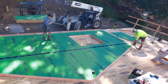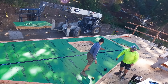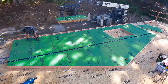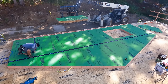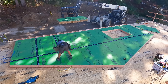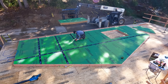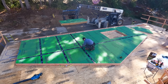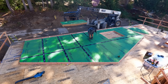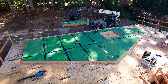This is why we trade everything off — you notice I just smoothed it with my hand as I went, then cut it off and we're going to roll that tape. You have to roll the tape — it's a pressure-sensitive acrylic adhesive. Now Kyle can run through and tape all the seams. Here's an advantage of not staggering your seams: you can literally just run top to bottom or bottom to top. We ran the horizontal seam first so that these seams overlap it. This is a self-terminating flashing — that's part of how the system is designed.